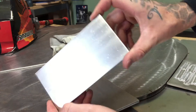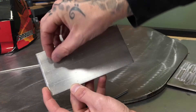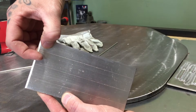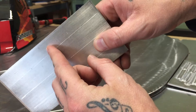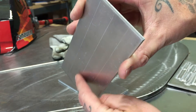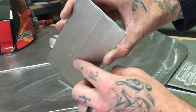I have cleaned both pieces of aluminum with a wire brush as well as acetone, so they're spick and span. I'm going to be following these scribed lines and it's going to tell me how well I'm doing that day with the machine and weld settings I'm using. I'm gonna be eyeballing my weld width — the amount of weld on either side of the line I want to keep fairly consistent. This is also a great way to check how your tie-in or stop-starts are. It'll keep you nice and straight but you will have to eyeball the width on either side, which gets your eye warmed up as well as adjusting your foot pedal up and down to keep the same width the whole way.